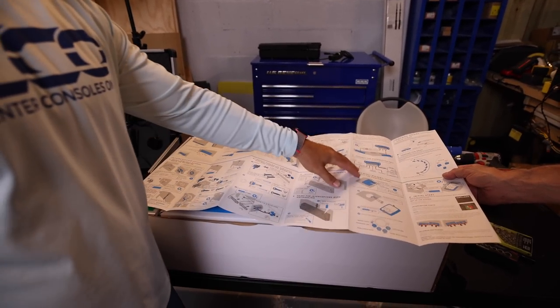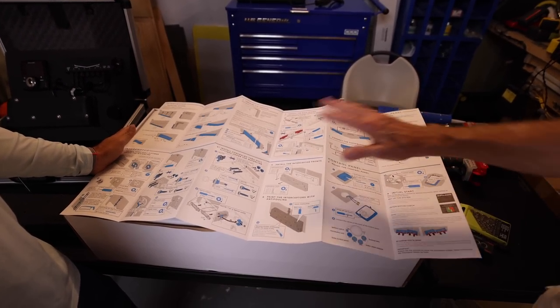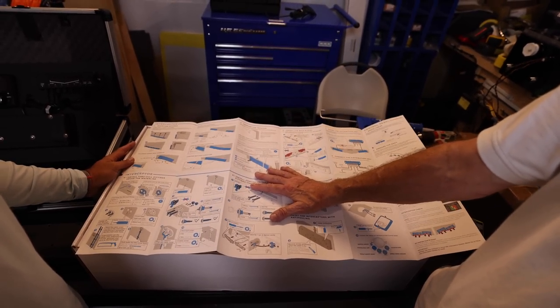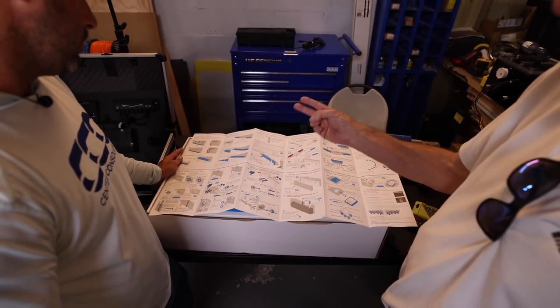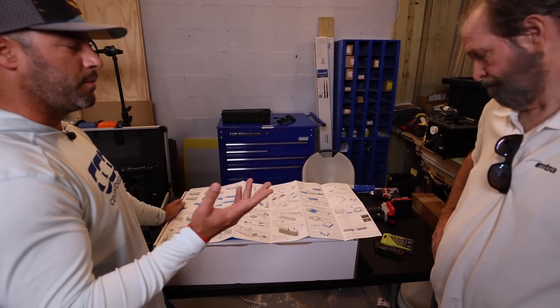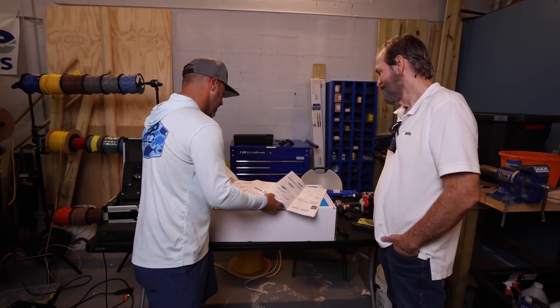Looking briefly at the instruction manual, we can see the interceptor, control panel, and distribution unit. The manual is very graphic. There are two ways to mount depending on how you need to run the wire. It gives you options, then goes into the distribution unit and control panel. The three major do's for installation are: nice and flat surface, not too much sealant, and mind the torque settings for the motors and cover plates. Some of us might be compelled to paste on 5200 or 4200, but there are components inside where you don't want sealant working its way through and seizing your interceptor.